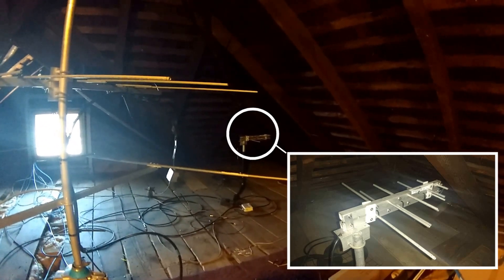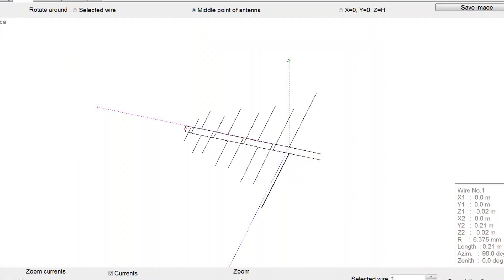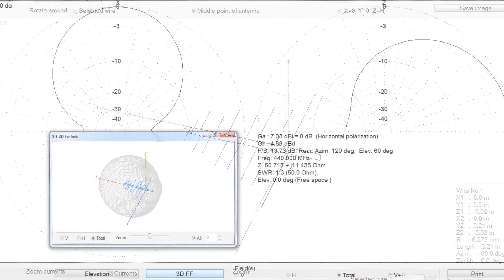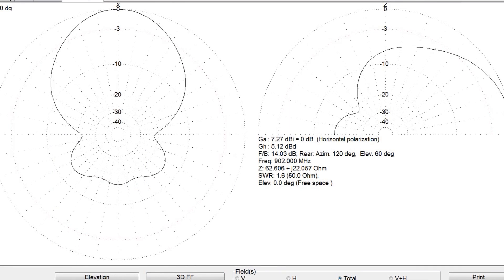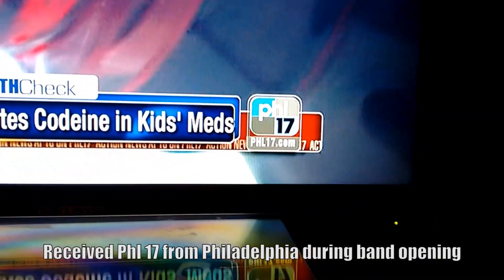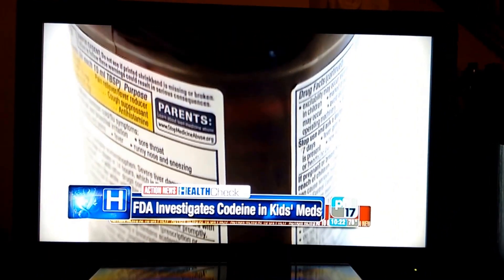Surprisingly, when I designed this antenna I kept in mind ham band use. So this antenna transmits on 440 and 900 megahertz. SWR is less than 1.5 to 1 on both bands — really happy about that. But it really pulls in those HDTV signals pretty good. I got almost 70 channels from New York City and maybe further area.